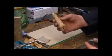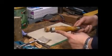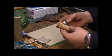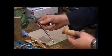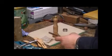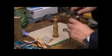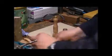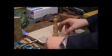The handle is nearly complete with a new ferrule to fit on the end, essentially doing this the same way I used to do the mortise chisels. We're going to cut this down and fit it — I'll do that off camera and then bring you back when we start to clean up the actual spike itself. The handle still needs to be drilled and this hole needs to be just under 8mm, so no doubt I'll have to find an imperial drill to get close. I'll get this done off camera and bring you back when I've got the spike in the lathe.